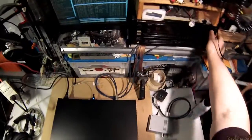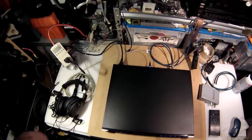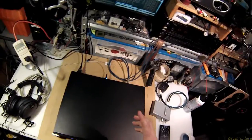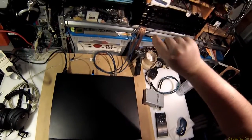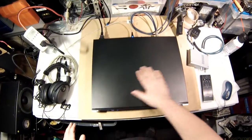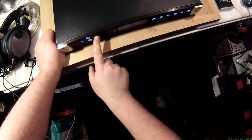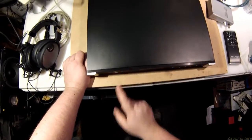It's an amazing-sounding headphone amp. Someone said they read a poor review about it but I haven't seen it. Since it uses the stepladder resistor for volume, there's zero difference between left and right channel — which is an obsessive-compulsive thing of mine. This is a digital volume control that runs through a literally analog stack of resistors; that's an amazing feature that more things need. On the front you've got mute, volume, dim with five levels, and a standby button in black — which they actually have to call out in the manual because it's hard to see.